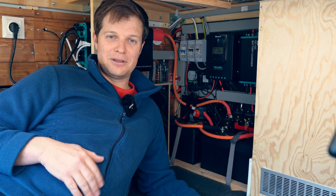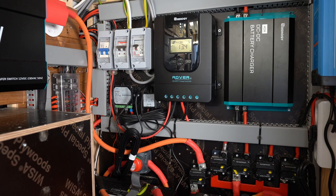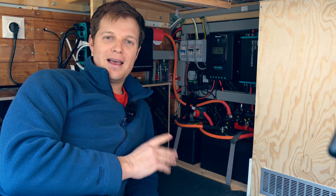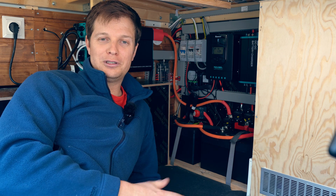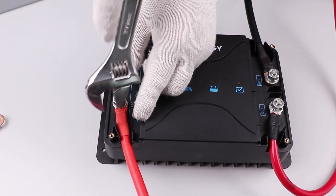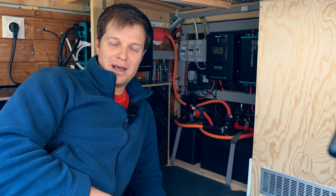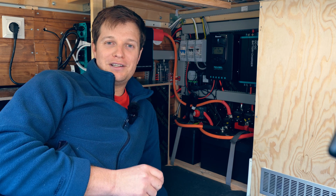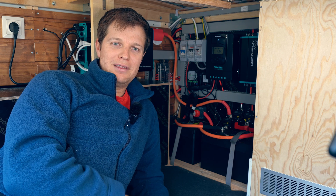So I did tell you I'd show what we did wrong. Our two lithium batteries can only handle 50 amps continuous charging current, but our DC to DC charger uses 40 amps and our solar has the potential to use 40 amps as well — that's too much combined. To fix this, I'm going to get a normally closed automotive relay, switched on from the same D-plus ignition port as the DC to DC charger. When the ignition comes on, it will open the circuit and disconnect the solar panels from charging the batteries. We could have gotten the combined DC to DC and MPPT charger that Renogy sells, but I didn't want that because it limits charging current to 25 amps. Probably should have also gotten smart batteries with Bluetooth built in — having the module you plug into the network port works, but a built-in Bluetooth option would have been smarter.